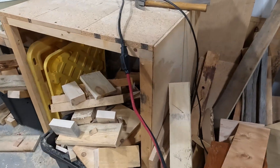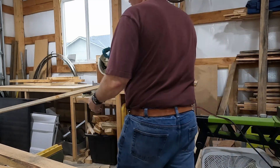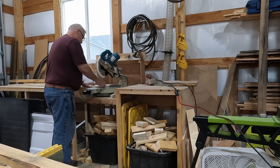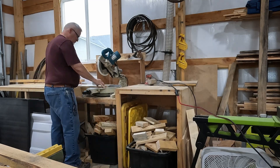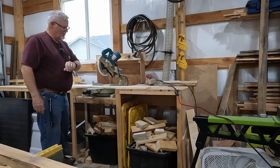After shutting the planer down, I went over and hooked up my table saw, ran the board through — no problem. Took off half an inch on either side and got it down to five and a half inches. Then I ran it over to my miter saw, but I forgot to run the extension cord over. So I went ahead and hooked up the extension cord to the miter saw and ran a couple cuts. The miter saw drew 1,370 watts.